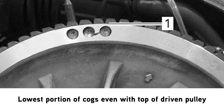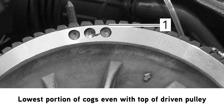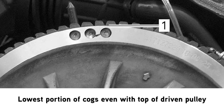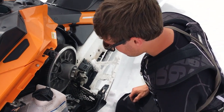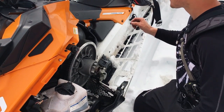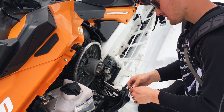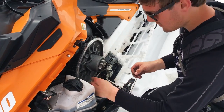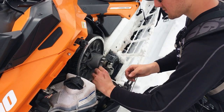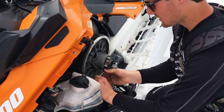I like to look at the ribs right here — the U marks. If they're just above the top of the sheave but you can still move the belt, I'm pretty happy with that. See, it's a little bit taller but you can still move it — it's still free. Then you just snug this nut bolt back up, and that's it.